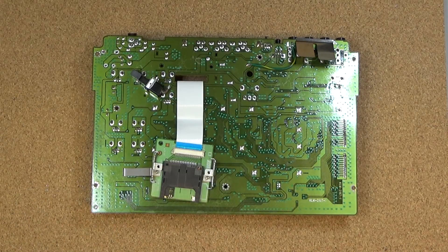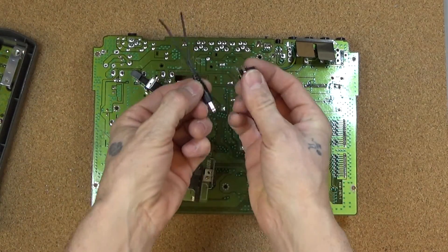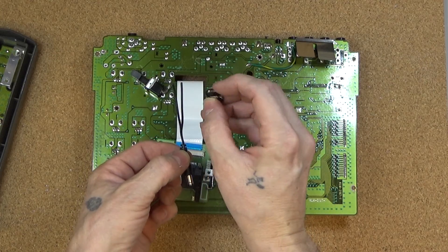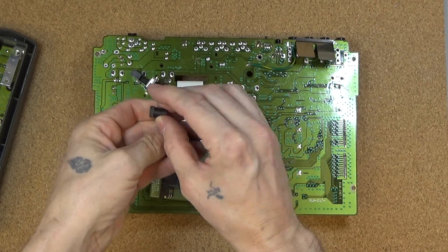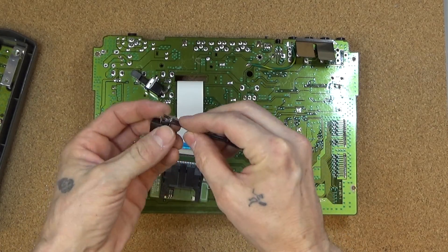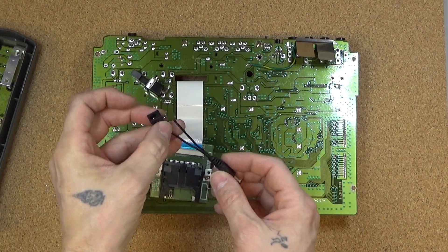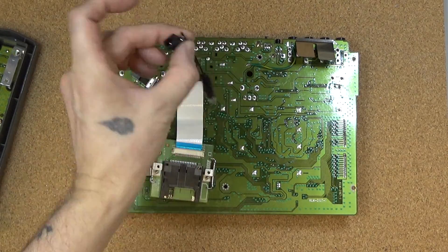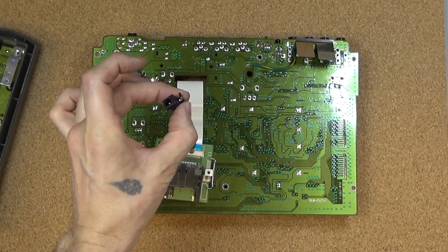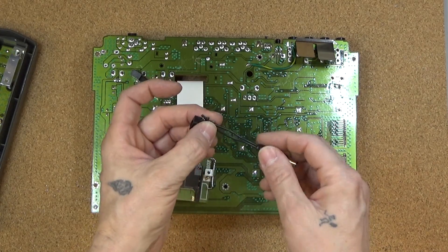Wait a minute — we can do it smarter. What I want to do is this: here's an old barrel jack, kind of ratty looking, hanging around here. I'm going to solder this onto the cable, and maybe do some hot glue right here just to hold it in place. And this is going to be my nice little reverse polarity adapter for the time being, until I can get to Amazon and have them send me one out. Grand assumptions here — this is what I believe is wrong, and this is also going to help me test that out.